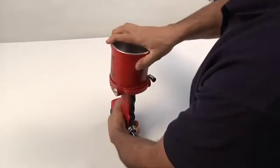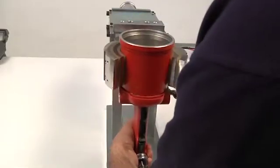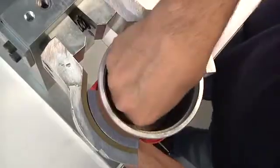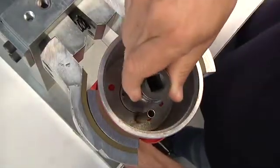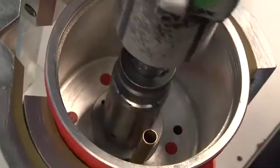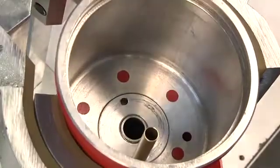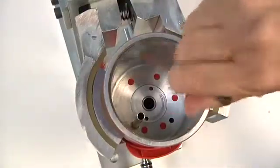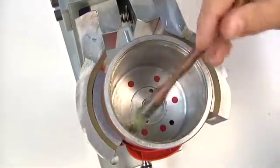While holding the hand grip, lock the assembled parts in a suitable clamp. Tighten the ring nut using a wrench, which can be supplied upon request, so as to fasten the hand grip to the pneumatic cylinder. Apply Panel special grease 2 to the inside of the pneumatic cylinder.